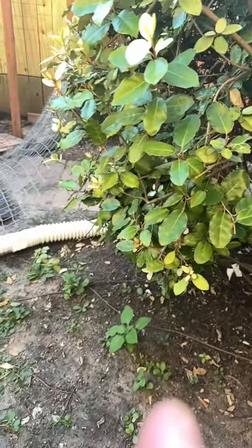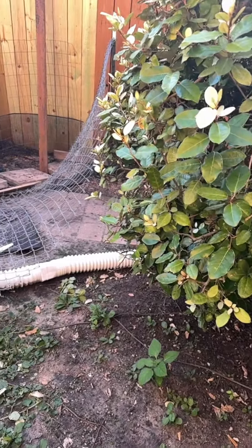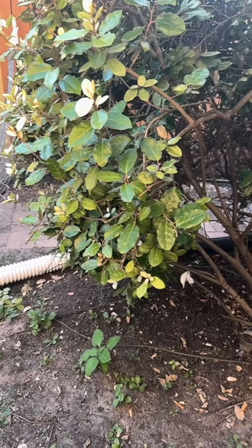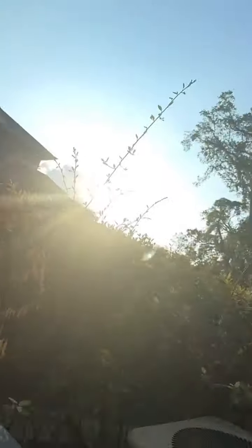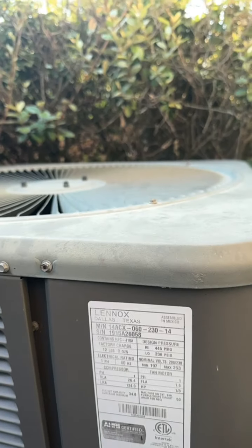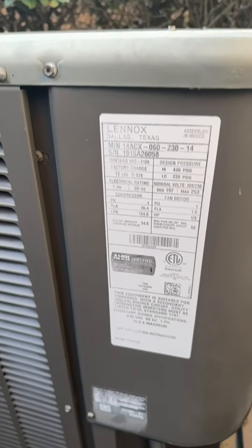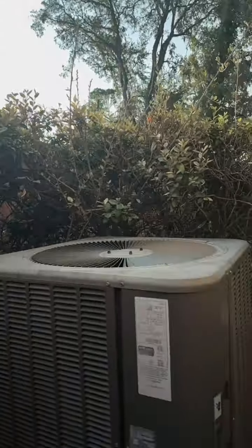It's going to be on a three foot by five foot by six inch concrete pad. We're doing a Generac 26kW, 22 and a half kilowatt managed load. I've already talked to Buster — he said we could do both AC units. They're both five tons, so we'll be opening both of these up on a managed load. The customer is very well aware that he will have to turn off one of these most of the time to use anything in the house.